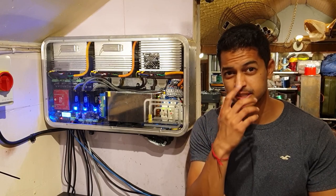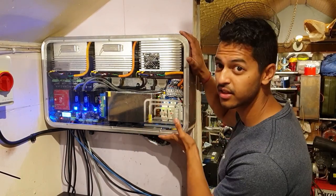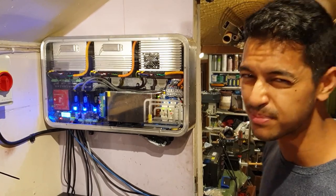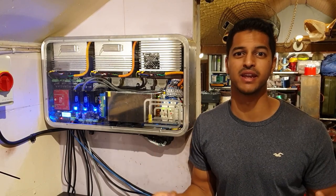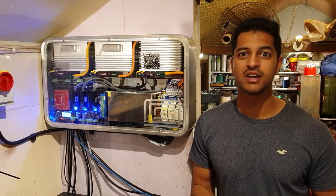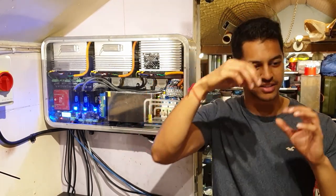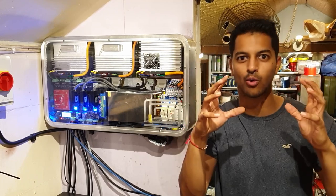In terms of going forward, the CNC machine that you've seen actually make this enclosure, I've actually cast all those parts in iron myself, so I've got some of the crucibles in the back over there. You probably can't see them, but anyway, I want to cast the bed. The bed's going to be made out of cast iron, about 120 kilos, so it's going to be cast in three parts. I'm going to cast the Y-axis. I'm going to buy an ATC tool changer. I've got a servo motor, and I want to cast all the variable pulley systems, the actual brackets and everything that hold all that together.